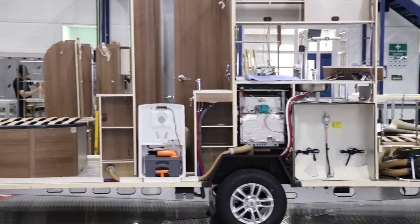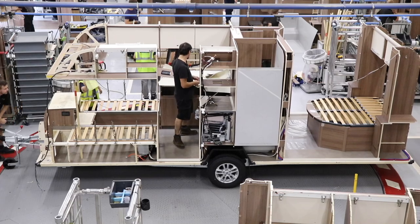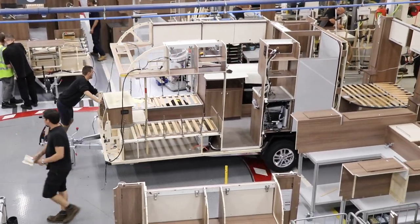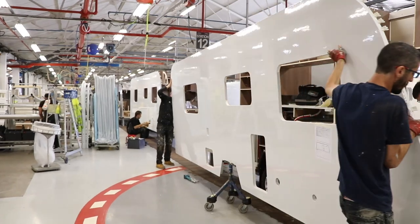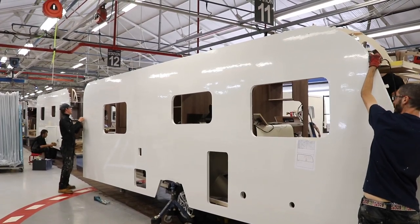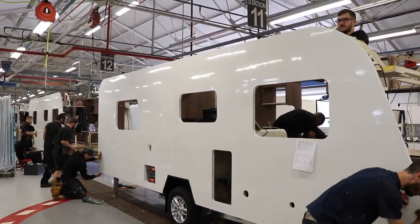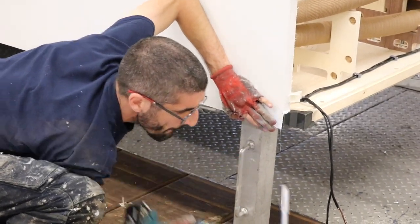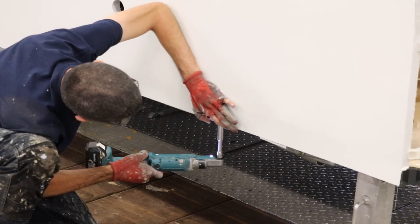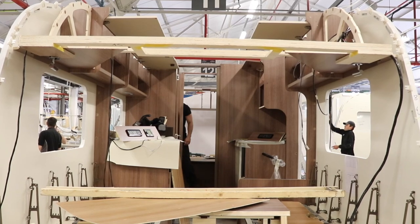This is how the caravan is looking so far. The caravan now has its upright sections added, including the overhead lockers and the wardrobes. Once done, it's rolled on to station 11 where the panels are added. These sides have just arrived from the panel plant and are fitted straight onto the caravan — the sides provide the caravan some much-needed strength. The caravan sides are roughly placed on the floor and while held in place, the captive nuts are run through the floor and into the side panel.